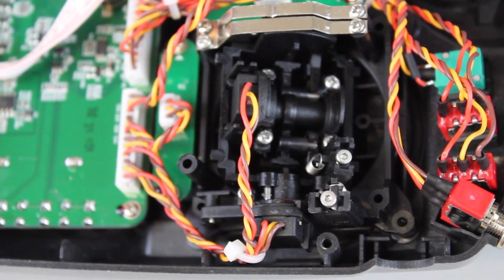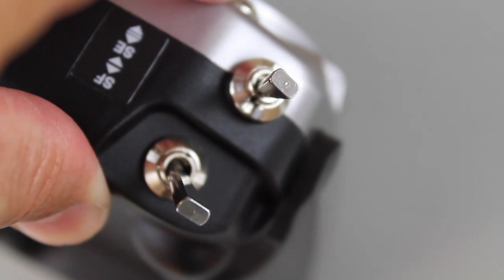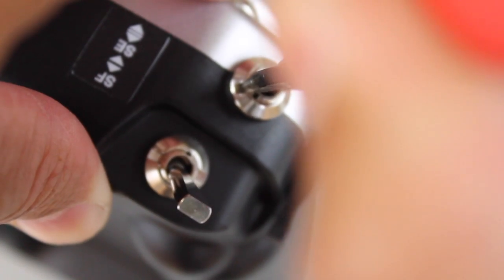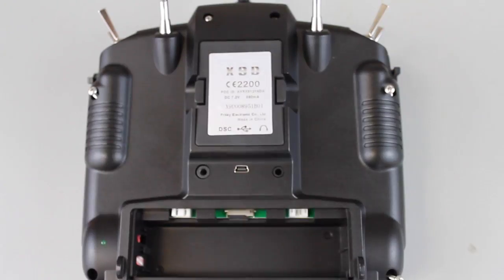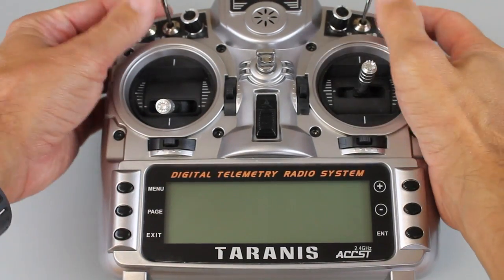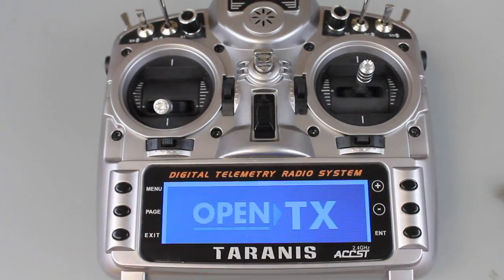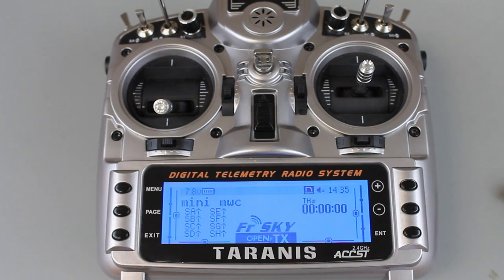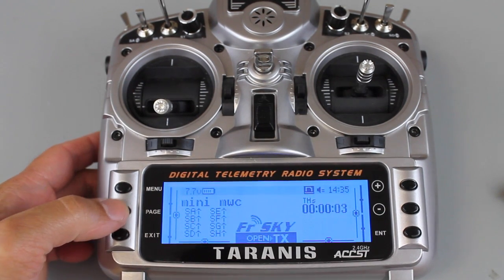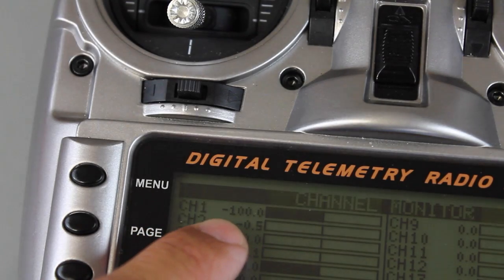Then we'll do a stick calibration with the OpenTX firmware. Now with it snapped back together, we're going to hold it in place. I'll put this switch in the middle and tighten that down, then do the other side as well. We'll make sure our throttle's all the way down, switches in their default positions, and turn it on. Look at that — no throttle warning. See the flight timer still at zero. If I push up a little bit, now you'll see it start counting. If I go all the way down, it'll stop again. Let's check the stick monitor — channel one at minus 100.